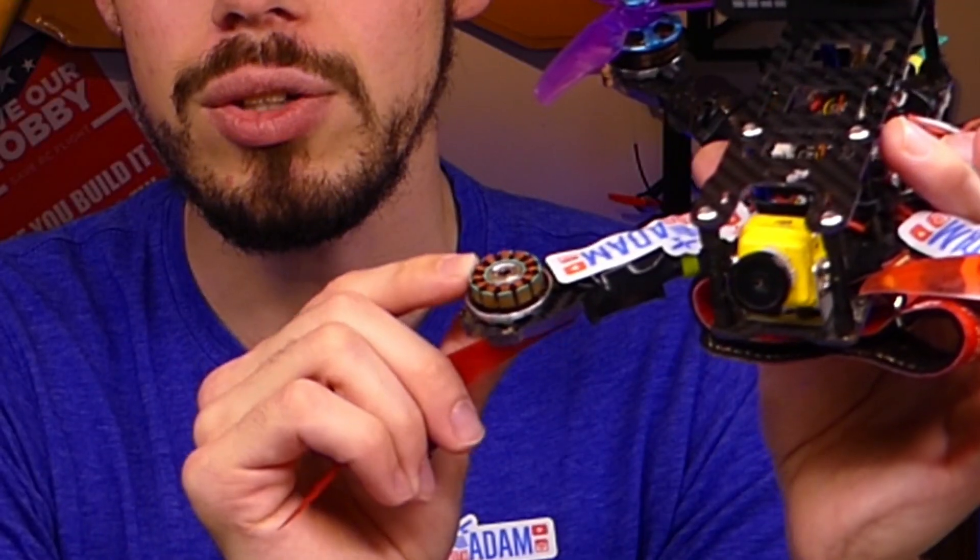What are the advantages or disadvantages of taking apart your motors during transportation for a more compact quadcopter? The advantage is your quadcopter is a lot more compact. Another advantage could be that if you're going through a really dusty environment or there are metal particles around, you'd want to take off your rotors — which have magnets inside — and put them safely in a bag. Of course, that does leave the stator and all the windings open to damage. The only real disadvantage I can think of is that your motor flies off, which would be really bad. But let's find out if that actually happens.